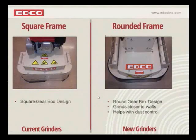All right, let's move on to the next slide. We changed the frame on the machine a little bit. You see on the left-hand side there, that is our standard grinder, the old style, and it's got a square gearbox design, and that's pretty much remained the same since way back when. We went with a new rounded gearbox design, and basically what that does, it allows us to grind closer to the wall, and you'll see when we talk about the shroud how it helps us with dust control.